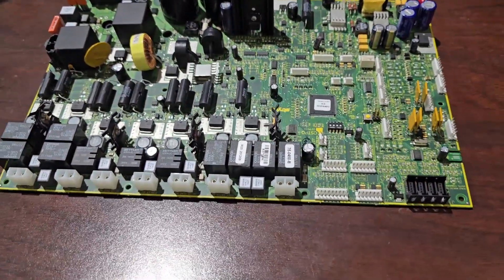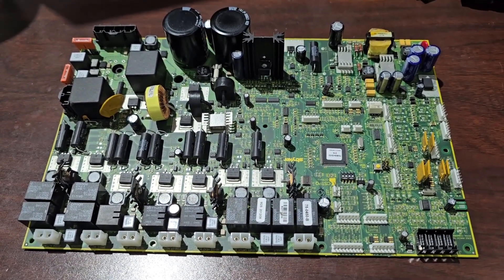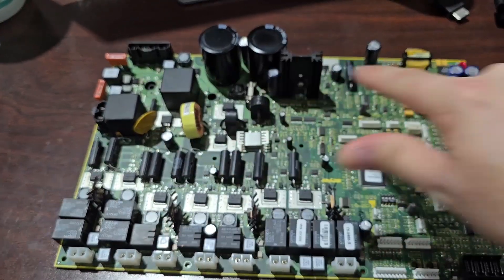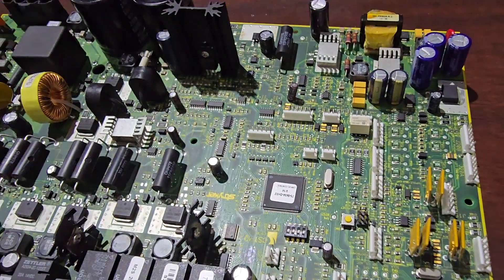That is a layout — a very good layout of a very complex PCB. I've never seen this board before in my life, but it's really not that difficult to figure out what things do. In this case some things are labeled, but if they're not labeled, use the size of the port, the configuration, and the orientation to figure out what it does. A big indicator is always going to be the size of the connector. Being familiar with components and their orientation in certain configurations is going to immediately give you very big clues.